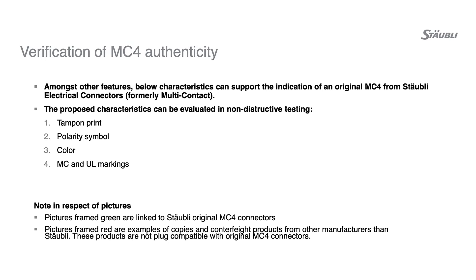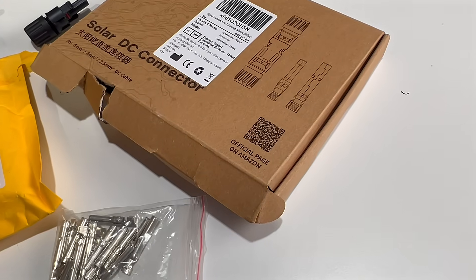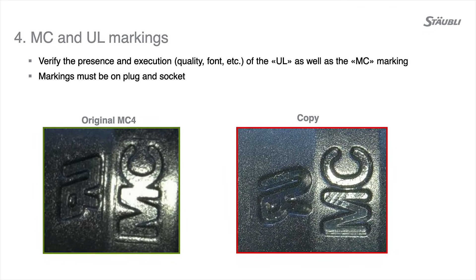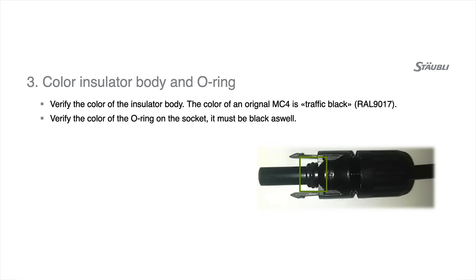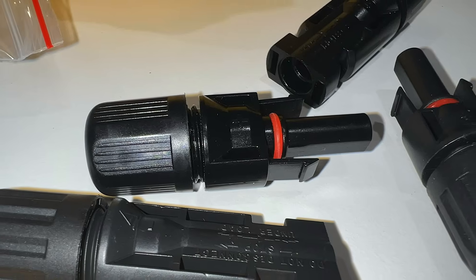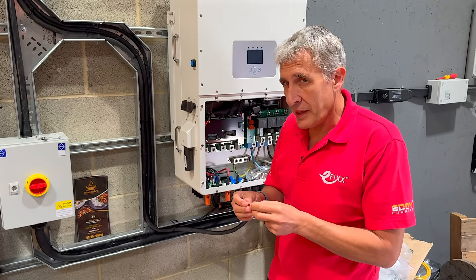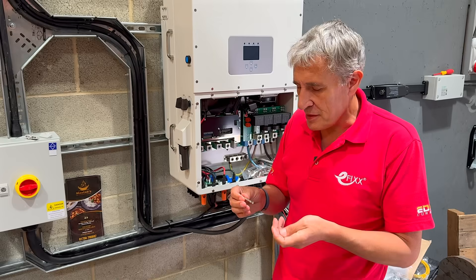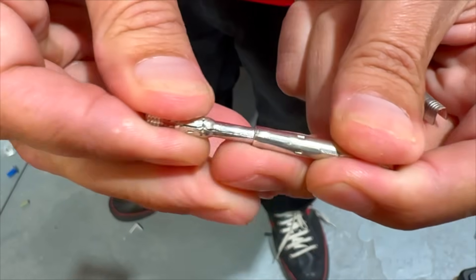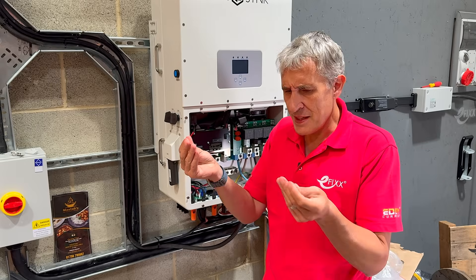While trusted manufacturers have introduced innovative alternatives to the original MC4 connectors, including tool-less versions, it's crucial to be cautious of counterfeit connectors that falsely claim to be original MC4 products. We purchased a selection from a well-known online retailer known for next-day free delivery. Many users find that the look and feel of these cloned versions fall short of the genuine connectors. A key indicator, as noted by Stäubli, is the color of the O-ring on the connector barrel: original MC4 connectors always feature a black O-ring, while these clones typically have an orange one. Looking at our crimps within these connectors that aren't actually MC4s, you can even feel the difference — this one slides like a trombone, while this one has some reasonable resistance. So what does that difference actually do to the contact resistance? And what if you mix these ones with the others, because they do look almost the same?